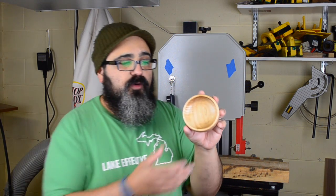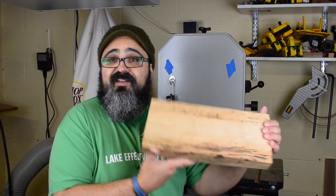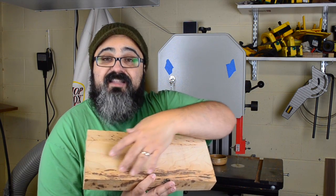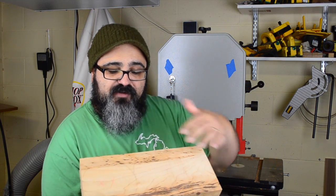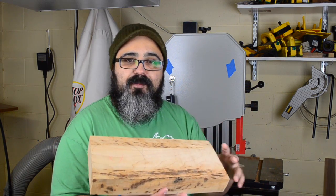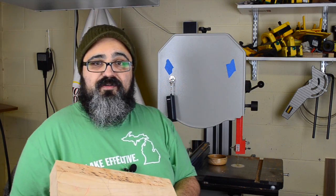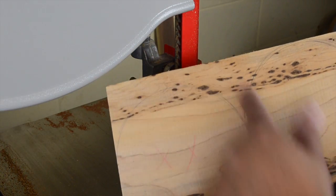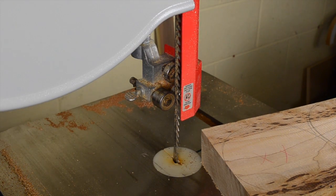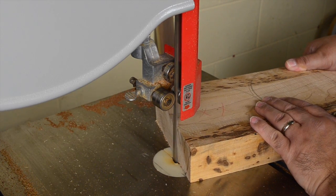The first thing we need to do is rough out the shape of this bowl — it's pretty small. Turning to some scraps I have left over, this is some more maple and it looks like we've got a little bit of spalting or some more figure going on in here. This will be my first time working with something like this, so it's going to be really interesting. I'm going to cut out two blanks just to have a backup in case something goes wrong. To do that we need to take this rectangular piece and make it roundish, and we're going to do that with our bandsaw. I'm not overly worried about making them perfectly circular from the bandsaw — we'll take care of that at the lathe.